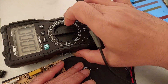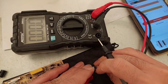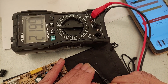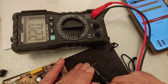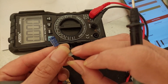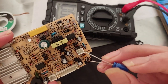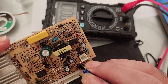Let's make a test with the capacitance position. It's showing 220 exactly — so this new capacitor is at full capacitance, full value as stated on the body. So yes, I'm going to replace the old one with this new capacitor. The black side is for negative.